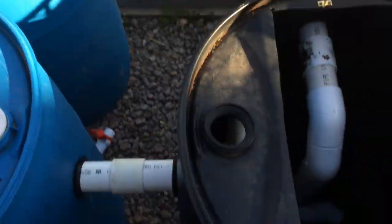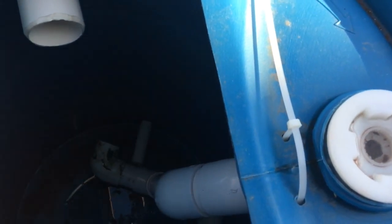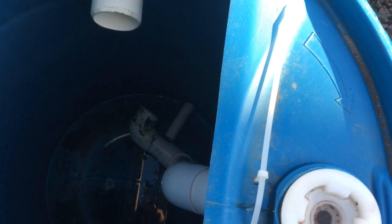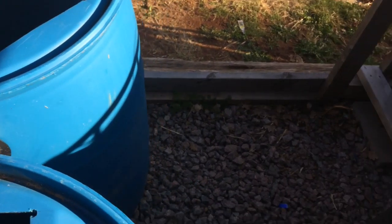Here I've got a piece of 50-millimeter pipe tilted at an angle — that's going to be a surface skimmer. I need to put a filter cap on it, but for now it's a placeholder. That comes out to the next bucket — same idea. We drive straight to the bottom with a spin head that moves water around, and again come up to a surface skimmer taking water off the top. What's going to be in this tank is a bunch of brushes — about 100 millimeters across and 300 millimeters long — secured so that as material swirls around the surface, anything that crawls back up gets caught in those brushes. That way there's no way for particulate to get into the next tank.